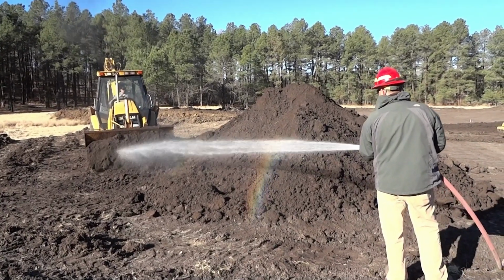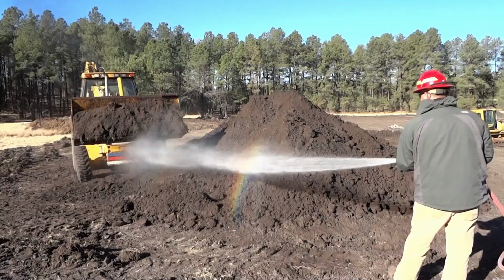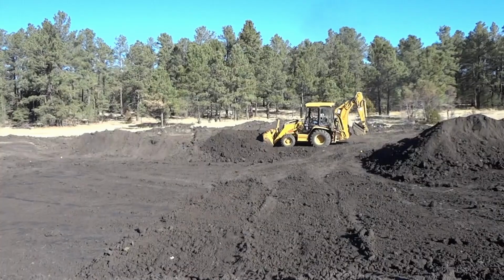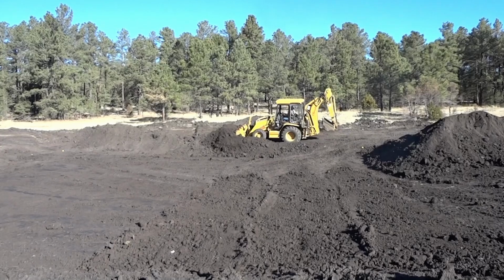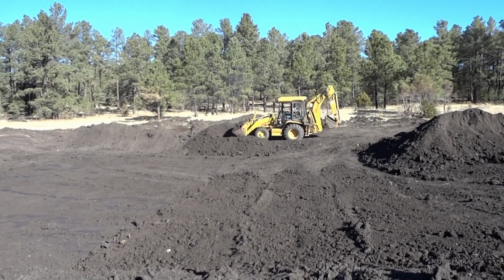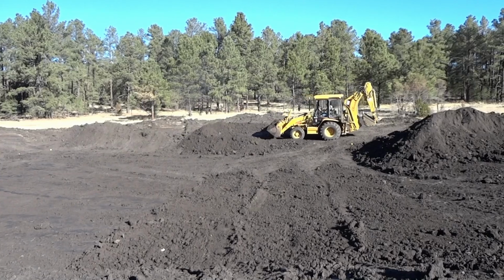We also had to be careful where to drive and to park the heavy firefighting engine with its large water tank so it wouldn't get stuck. Once the clay is mixed with water to the optimum moisture content, the backhoe operator scoops up moistened clay and then spreads the soil in a 6-inch thick layer.